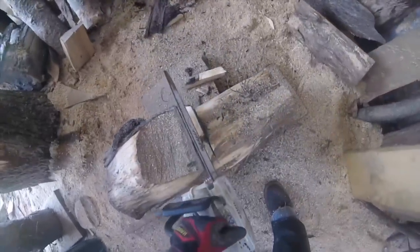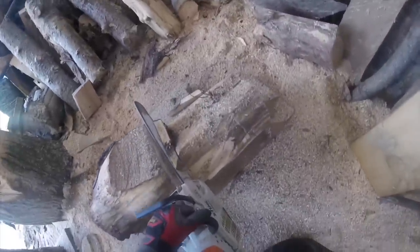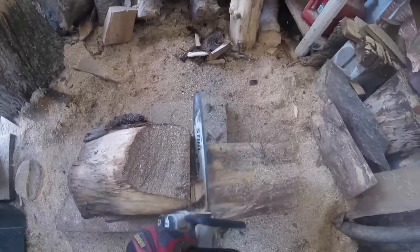Alright guys, so at this point I'm kind of angling the saw. As you can see, I'm coming in at an angle. Once I make that cut, I'm going to come back at another angle if need be and clean those chunks out. Once those chunks are cut out of the notch you're trying to create, we're going to have to use the saw kind of like a sander and work it side by side, just letting the chain kiss the wood and just sand it. It'll give you a nice, somewhat smooth surface in there for the end of the board